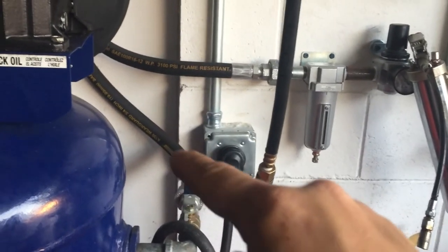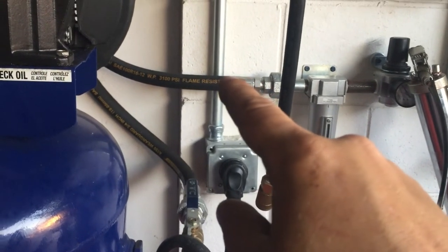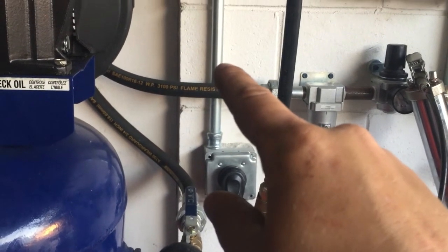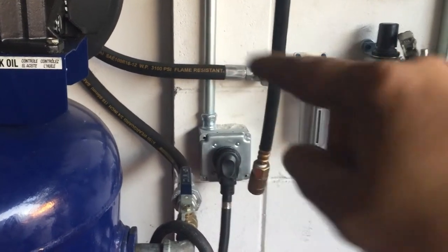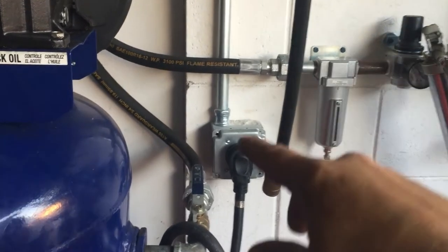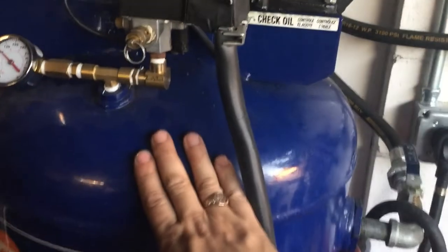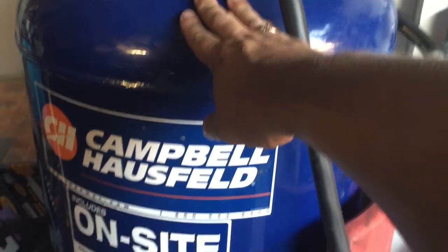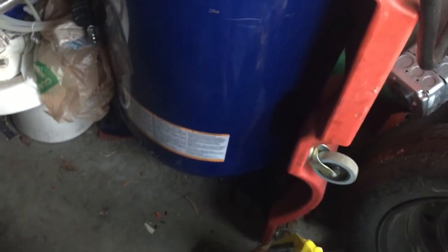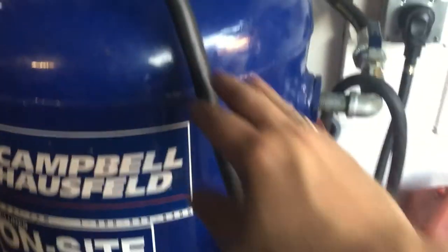The other reason I used rubber — well, it's not really rubber, it's nylon with metal weaving — is that it takes out the vibration from the rest of the tubing, working like a shock absorber. The pressure tank rattles on the ground; it's not bolted down, it's standing on rubber padding, so it runs on its own without carrying vibration to the ground.